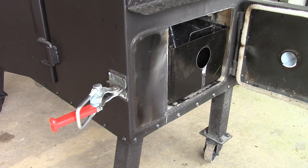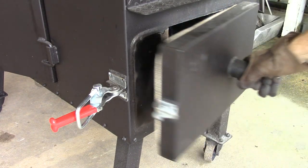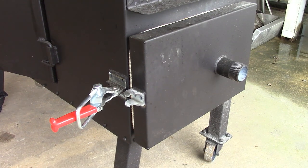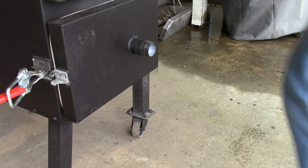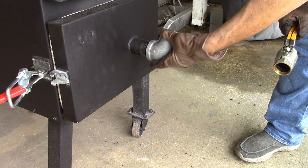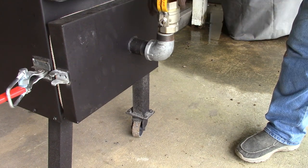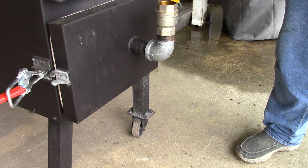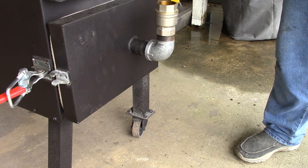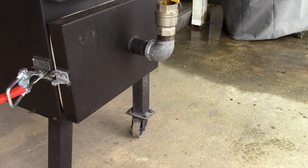I bought one of the fan bellows and a thermal whatever — but I hit it right dead center, so I was pretty lucky. Instead of having that bellows stick way out — like a foot and a half by the time you put it back on — I bought a one-and-a-half-inch street 90. I'll put some pipe tape or pipe dope on it, orient it like this, so the bellows will be up here. The wiring's closer, and if you have kids running around or you've had one too many sarsaparillas and come around the corner, you won't break it off — although that would be a $70 oopsie.